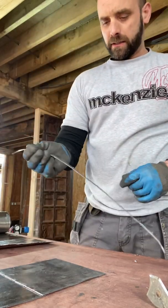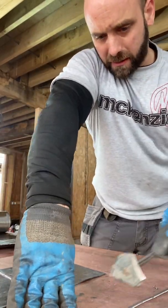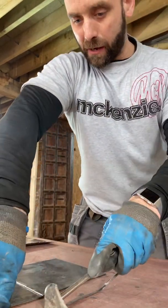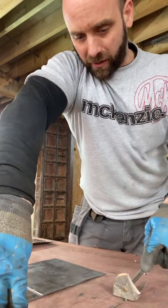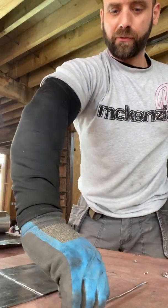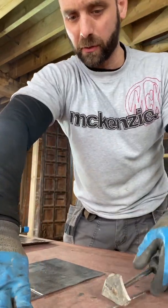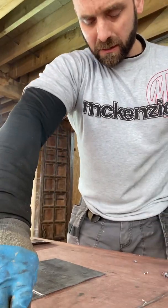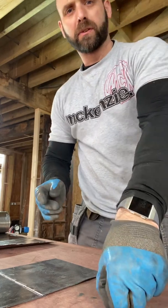What I'm going to do to that is also shave hook it to clean it up. I don't have to do this to be honest — generally on site I don't actually shave hook everything and I generally get it to weld quite nicely without doing that. But this will make it easier, so if you're a beginner just giving it a go, I'd recommend doing this.